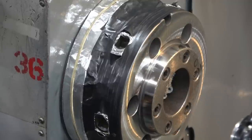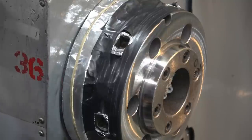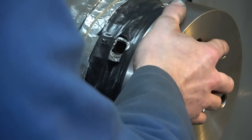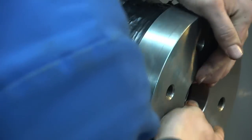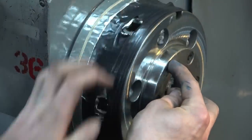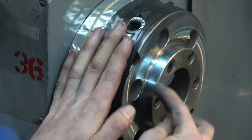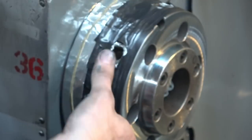While I was swapping cameras there you missed the most extraordinary sound ever to be produced by a grinding spindle. Did something blow up? No — but the rag decided to try and go down the hoover pipe. That was just over a thou taken off. Got a bit of a different feel to it this time. The taper isn't really revealing much — heavy contact on the top where I was pressing and nothing all around here. So perhaps I need to take a little more off.